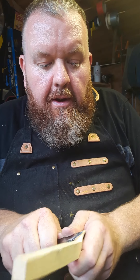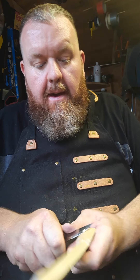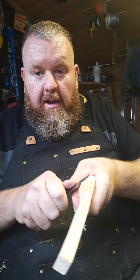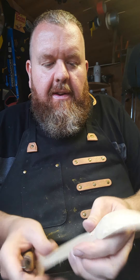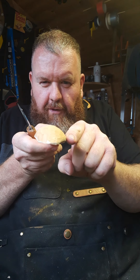Remember, cutting down all the time. Just giving the back of the bowl a bit of a shave and a clean up — you can take it as clean as you wish, because the more you take off with the knife the less you've got to sand. Just generally, holding the knife and slicing the top, moving some of the chunkier bits. Keep looking, keep checking the depth — you're trying to get a good uniform dome shape.